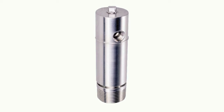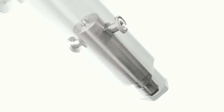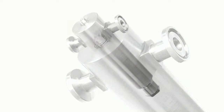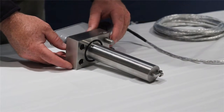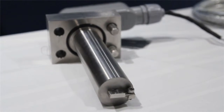The 372 sensor is also available with a removable jacket. The 374 sensor incorporates an integral heater and half inch sanitary process connections, making it the ideal choice for a wide range of biopharmaceutical and research and development applications. The 392 sensor is designed with a rugged four bolt stainless steel flange and fits easily to any pipeline size over one and a half inches.